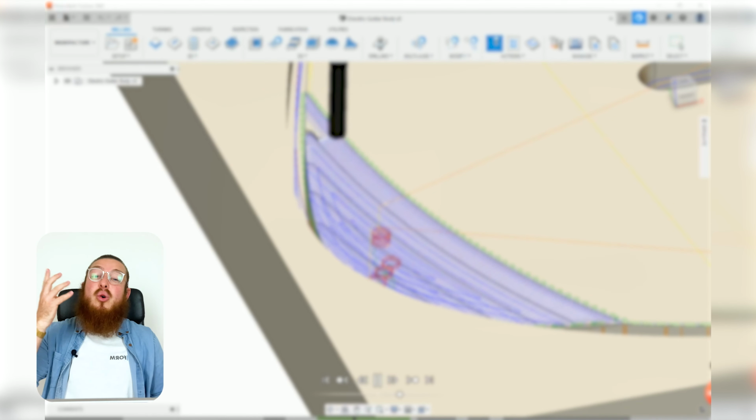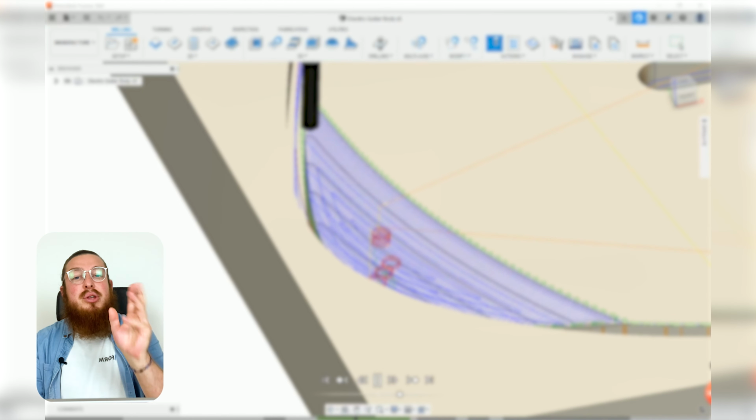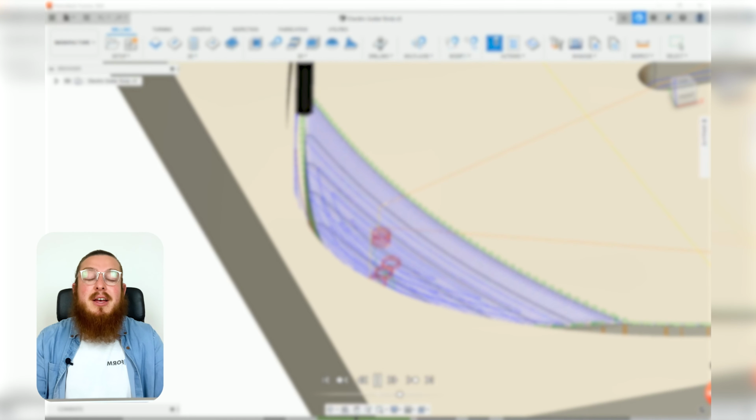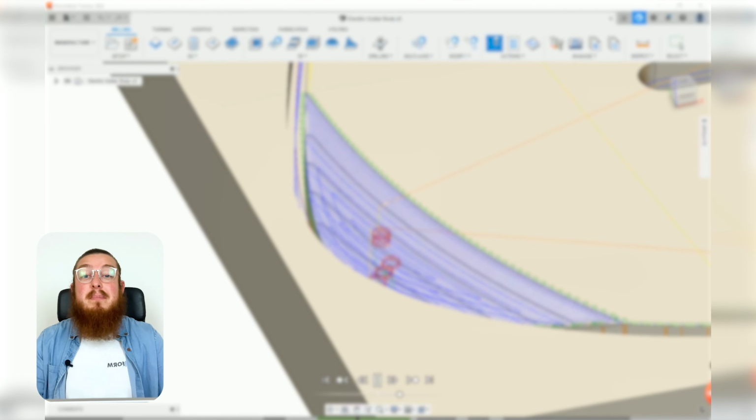We're going to be using our 1/4 inch end mill, which is our bread and butter, and I want you guys to make a 3/32 inch end mill. You guys can find all the dimensions in your packet, but I want you guys to calculate all the feeds and speeds for this bit.